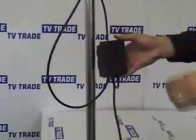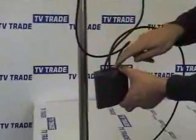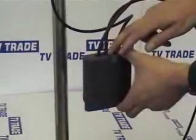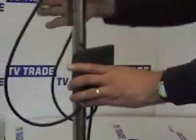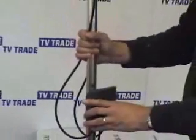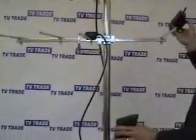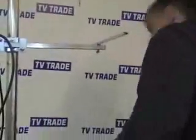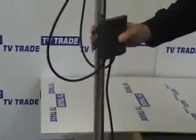Now we'll push this unit back and slide it down onto the pole. The most important thing with these diplexers, apart from ensuring the wiring is correctly done, is to ensure the diplexer is not held upside down. If it's mounted that way, water will follow the cables and flood the diplexer, and within a matter of days or weeks the diplexer will stop working because it will be waterlogged. So we hold the diplexer correctly and apply a series of tie wraps — one tie wrap around the back of the aerial and one here — clamping it in place. And that's it, more or less complete. The diplexer has been successfully fitted.